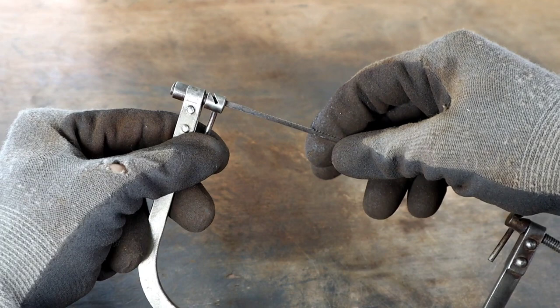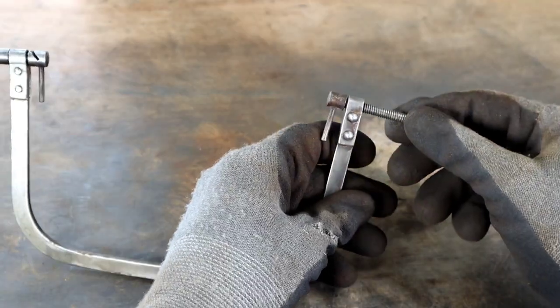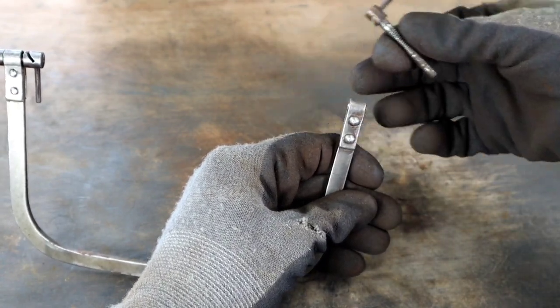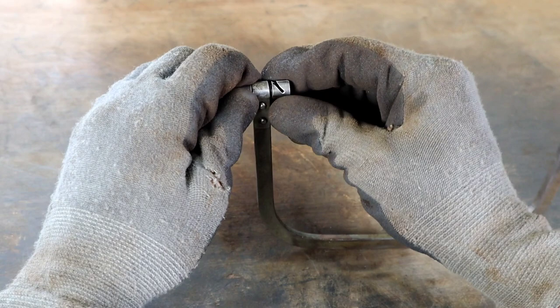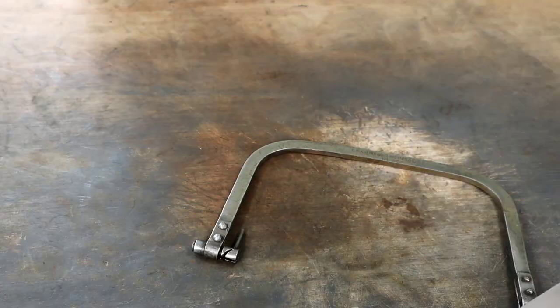Make sure you're wearing eye protection here just in case, because those pieces will shoot off in an unpredictable direction. This arm was designed to go into the handle almost a full two inches to give the saw stability when you're cutting. Check the handle for play and look over the screw for any damage to the threads. If you see any, use a thread cleaner or restorer depending on the condition of the screw.